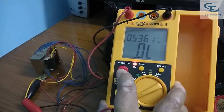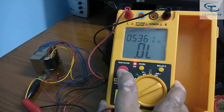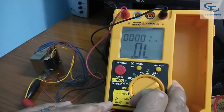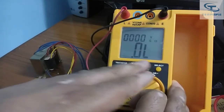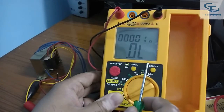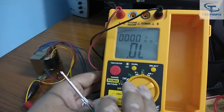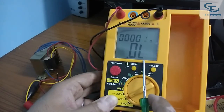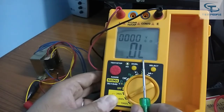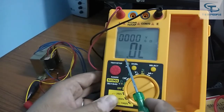The red LED is on and it is showing 'OL,' meaning the result is beyond this range. At 500V the instrument can measure up to 4 gigaohm, so the result exceeds that. If the result is within range it will show the value; if the result exceeds the range it shows 'OL'; if your sample is shorted it will show 'Err.' Remember these three conditions.